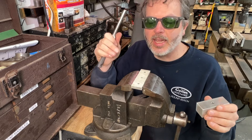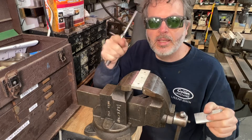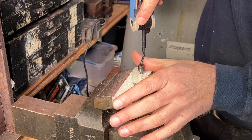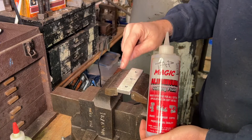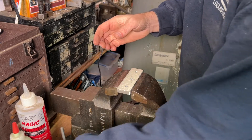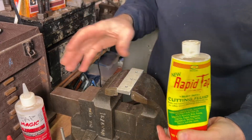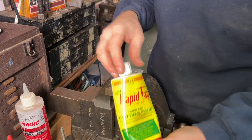Method number one is tapping by hand in the vise with the tapping block. I've already drilled the holes with the number seven drill bit. First up, I like to deburr these holes — I'm using this little Noga rotary deburring tool. That gives the tap a nice start into the hole. You're definitely going to want to use some sort of lubricant, some tapping fluid. Since we're doing aluminum today, I'm using Tap Magic in a little dispenser with a brush. You can also use Anchor Lube — this is a water-based product. If you're in steel, I really like Rapid Tap. Any old oil won't do — you've got to use a tapping fluid. It really does matter. Rapid Tap compared to motor oil is night and day.